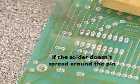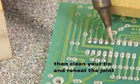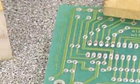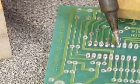Also, it's important to keep cleaning your soldering iron with the mesh. If you put too much solder on, then what could happen is it will actually bridge the next pad and therefore short your component.